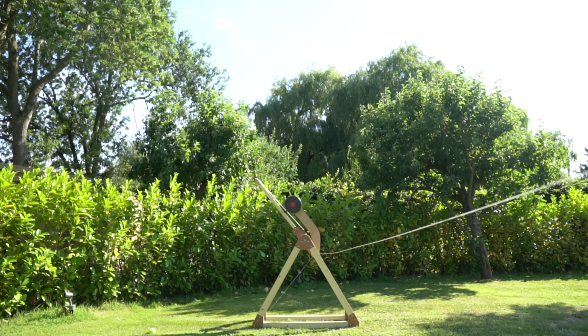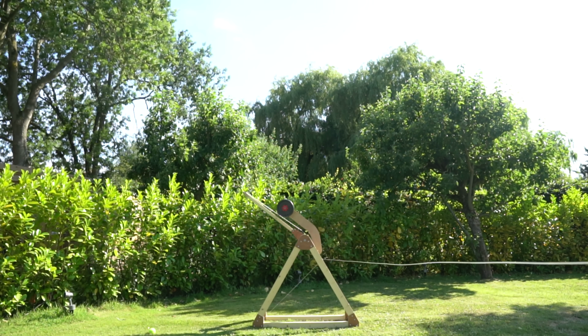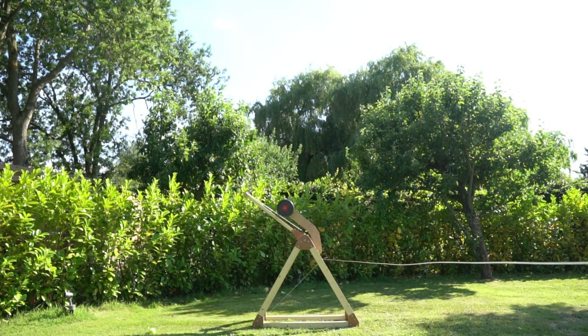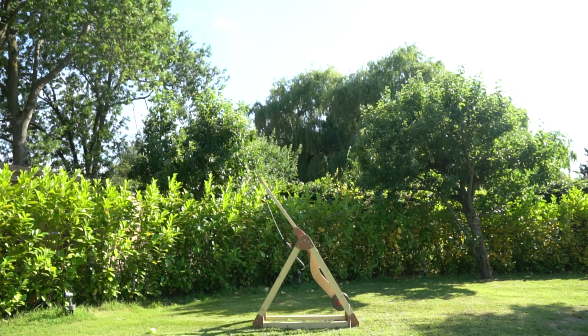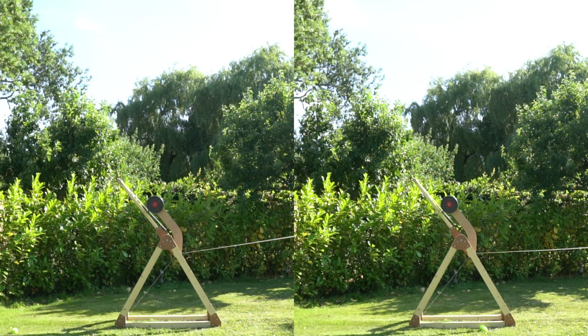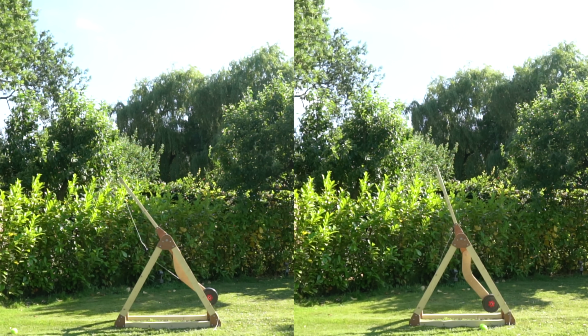How about a sling length which lines up the centre of the ball with the axle, aka the exact same length of the long arm? This launch looks almost perfect in comparison. The weight stalls at the bottom of the drop, then 0.04 seconds later, the arm stall and the release of the projectile occur simultaneously. But how much extra energy is transferred to the projectile when the arm doesn't oscillate after the launch, like it did with the short sling?